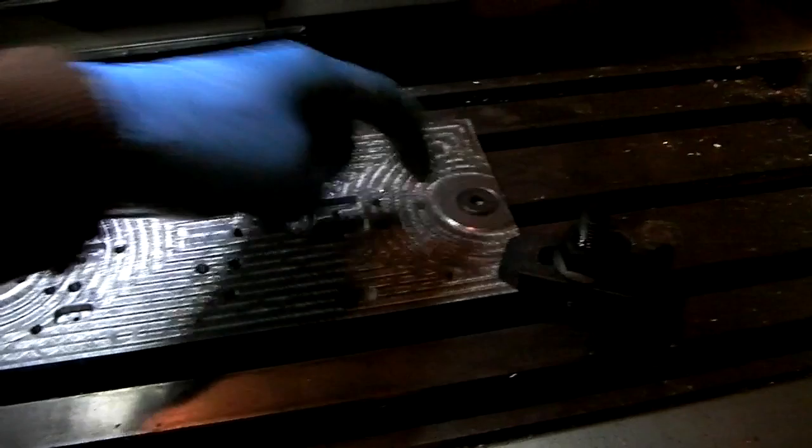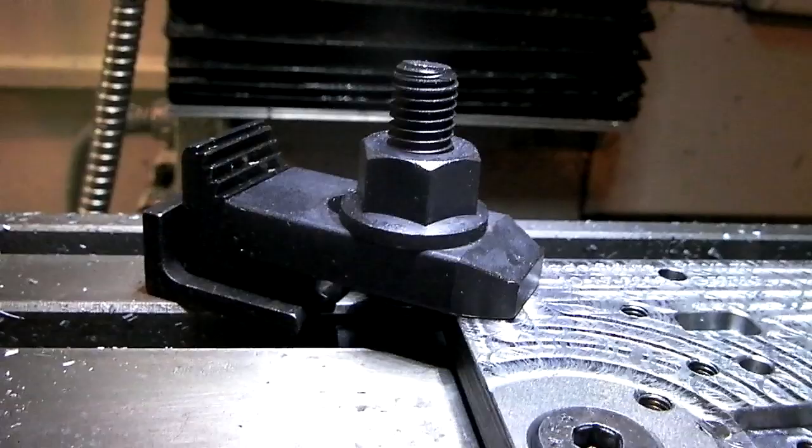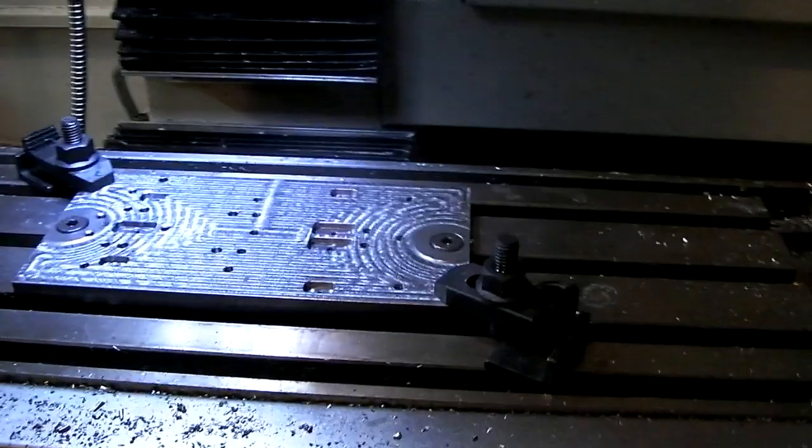So I've got these clamps on the outside. I don't know what the term for them is, but they're adjustable strap clamps, basically. These stepped ridges here let you raise this horizontal piece higher or lower to fit whatever size workpiece you're clamping. These things are incredibly handy. I've been machining for about 4 years, on the hobby level, and I've never used these until just recently. Usually they come in a set like this. You see them all the time. If you're into machining and buying stuff, you see these everywhere, and they're pretty affordable. But I've had this for 4 or 5 months now, and I never touched it until just recently. Eric's used it a few times, because he's smart enough to try new things. But I absolutely love them. They provide an incredible clamping force too, because they're half-inch bolts.